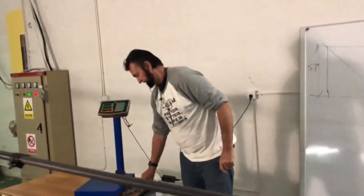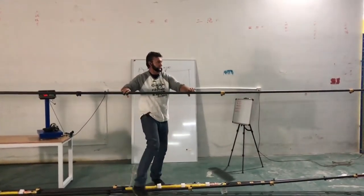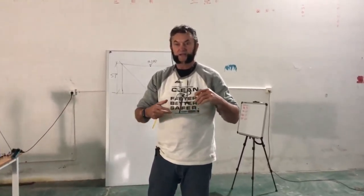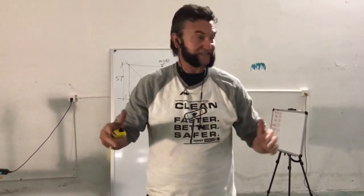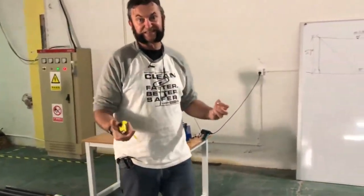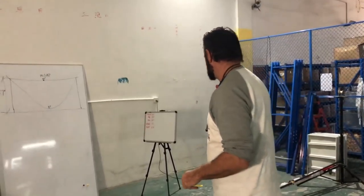Now, I want to adjust the set a little bit. Let me take this off and just say, okay, that's where we compared those two. So put that back on the scales, take this off, because we're going to be testing the Reach It Mini, the ABB Plus pole, and the tactical pole, the new pole for 2018, we're going to extend the length of these. So it matches, because the only way to do a 3-point flex test is to have the pole, all the sections fully extended, because that's the pole you're going to be using. You don't want anybody taking out the number one section and just using 2, 3, 4, and 5. And you don't want anybody just increasing the overlap on a pole so that they can get a better result out of the flex, because the more overlap you've got, the less flex you've got. So these poles are all fully extended, and then I can have a look at this.